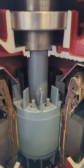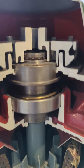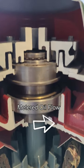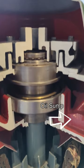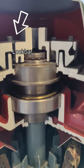Going up a little bit more, you'll see the air deflectors just above the rotor that direct airflow over the stator end turns, and you'll see the metered oil flow to minimize inefficient churning of oil, which comes off of the oil sump. And here we have our high thrust angular contact bearing, which is just below our lock bar and coupling.